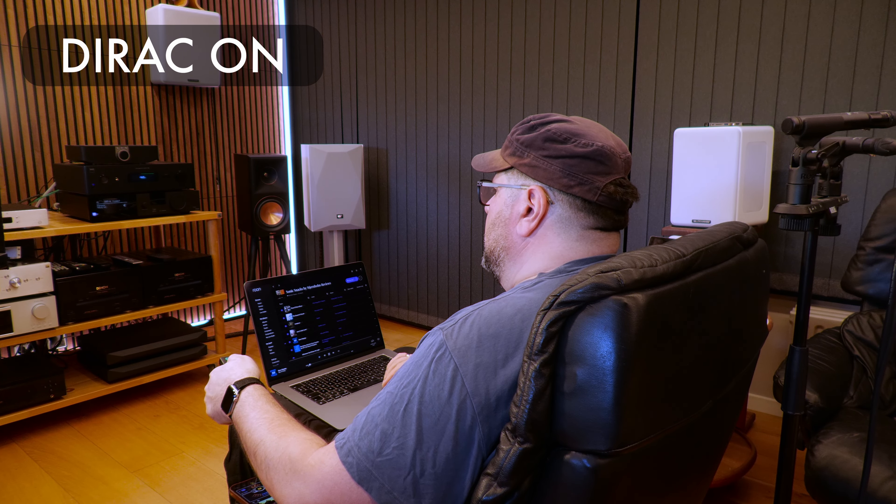I'm getting around 96 dB in the listening position from those little speakers with the tilting curve, which lifts the bass about 3 to 4 dB. The speakers, without the woofers reaching their end stop, can deliver around 100 dB in the listening position — pretty impressive. This expresses the headroom available when not playing that loud, which is really nice to know, especially for classical music or anything with wide dynamics.